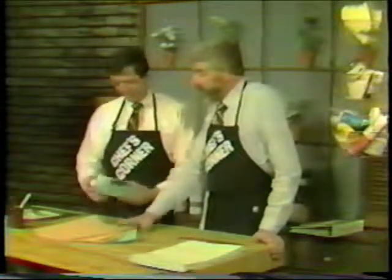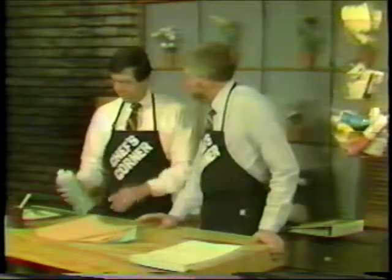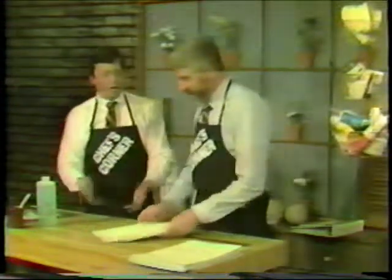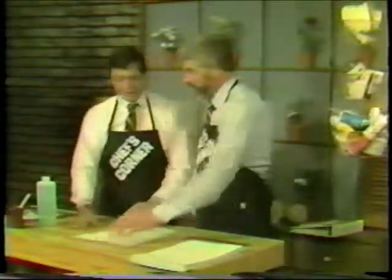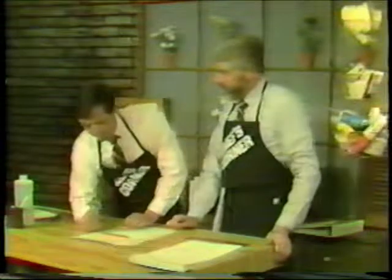That's good to know. So we're talking about using them on the duplicator. You must use the green etch, but we didn't talk about imaging them yet. No, we haven't. That would be logically my next question. How do I get an image onto the front of a direct image master? Very simple and very easy. Take one of these pencils here and you can image it with a pencil. Now, is this a special kind of pencil?